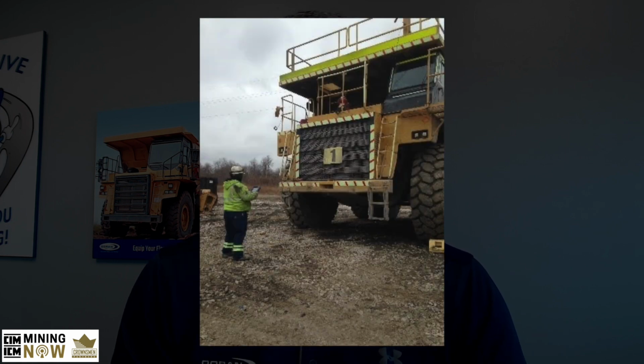Now, standing on the ground or sitting in your service truck, you can see, okay, truck number 105, all my tire pressures are within spec. That tablet is multifunction, so it also allows you to walk around and manually enter tire serial number and tire tread. You can also take pictures of the tires. If there are cracks in the tires or damage to the wheel, you can document that, save it to the tablet in a time and date stamped file, and then upload it or physically connect it to a laptop or desktop. Now you have a historical reference on that air check, on that asset, on that particular tire.